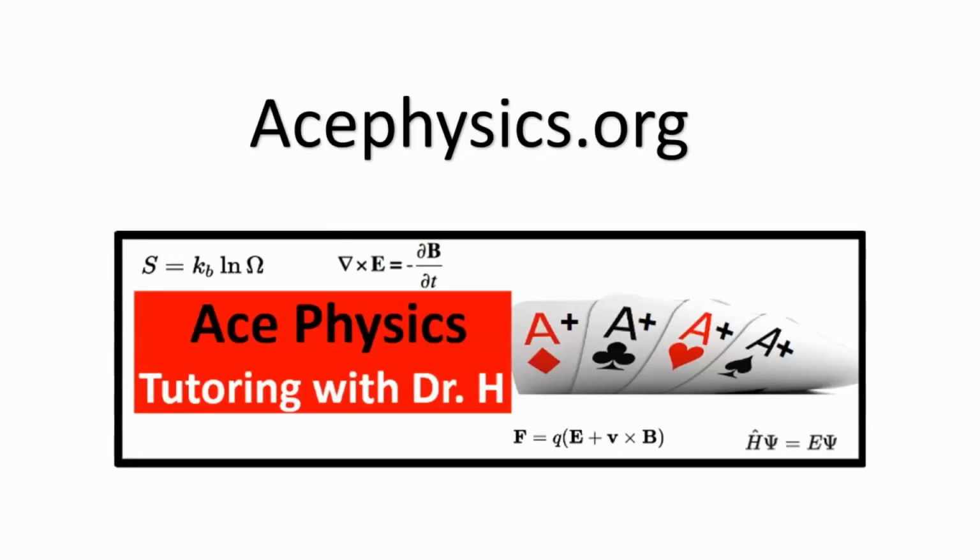from 27,000 revolutions per minute to 12,000 revolutions per minute, so it's going at a low speed mode. We want a low speed mode when we're doing the etching, because we're going to be letting gas in the chamber and the pressure is going to be higher, and so we want the pump to be running at a lower speed mode when the pressure's higher.